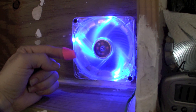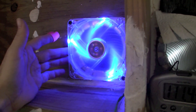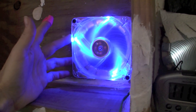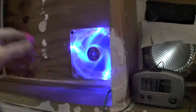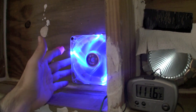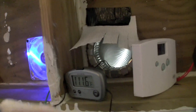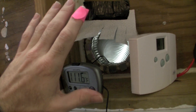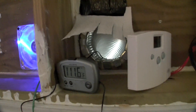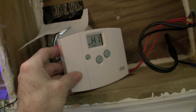So I put my finger in the fan earlier — as you can see. This is a 12-volt motor fan. It is forcing air into the tube, and then there's a bilge blower halfway down on the inlet side. What that does is it picks up the air, this fan distributes and forces it through. And as you can see, coming through that big unit, this is how much airflow we have, which is a lot. And it's very quiet because the fan's outside. This is what's running the bilge blower.